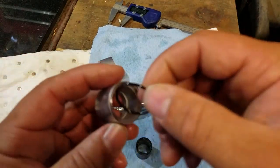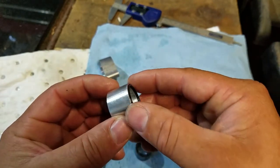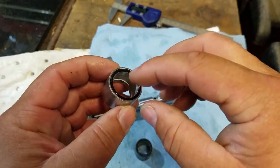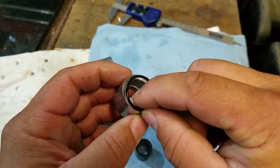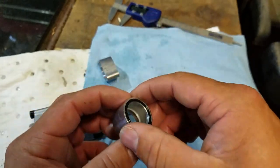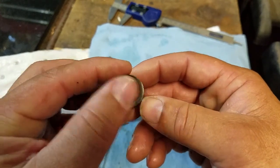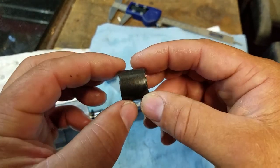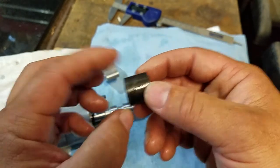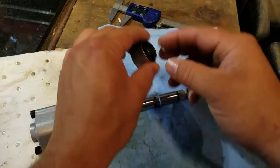That o-ring goes in the top here. On the bottom side — the valve side — this diameter is thinner, and the top side that faces the valve itself has the o-ring seat. The sleeve has notches on both sides and appears to be the same, so I imagine it can go in either way.